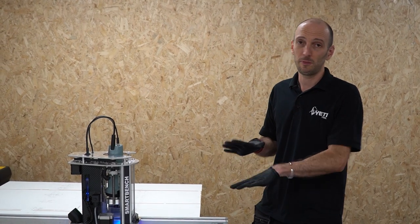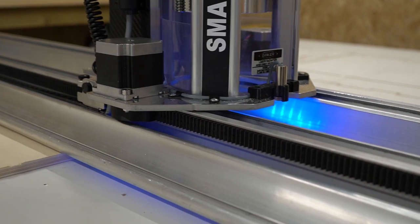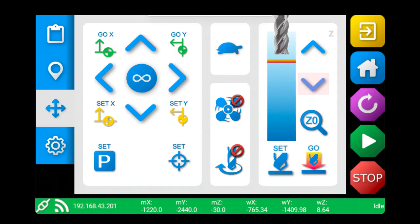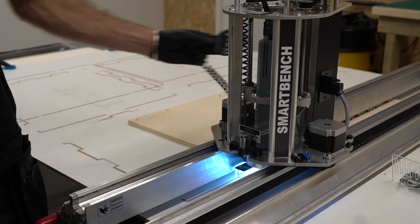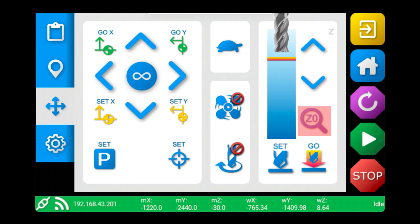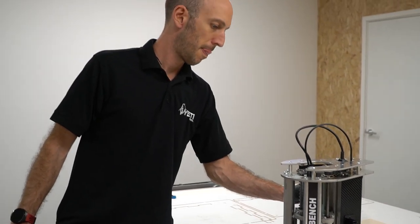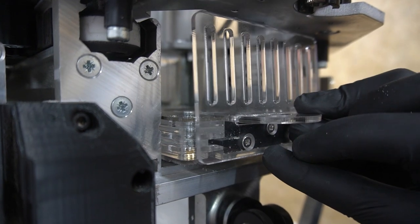The Z datum in the job file is on the bottom surface of the stock, so now we need to move SmartBench's working datum to align with that. I'll move the Z head so the tool center is clear of the stock and can reach the spoil board below. I'll take out the dust shoe plug and drive the Z head down so it's close. I'll insert the probe plate underneath the tool and press the probe button, holding the probe plate flat while the tool probes. On contact it automatically detects, saves the datum in that position and retracts. Now I need to reinsert the dust shoe plug, making sure the black part fits into the slots.